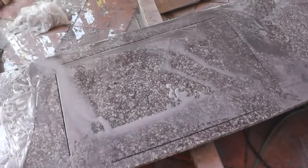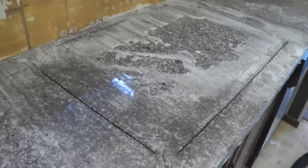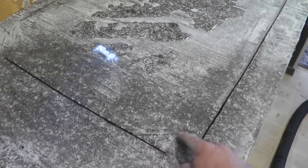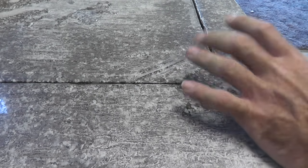I've just finished this fourth cut, and now we'll very carefully take it inside and finish up these corners with a grinder. We were able to successfully move this honker back into position, and now I'm going to use my grinder to finish this cut. I'll start by going diagonally at each one of these corners to remove this big piece out of the middle. And then I'll just start working around these corners and making the curve. I'm using a vacuum cleaner as well as a grinder to hopefully suck up some of the dust, because this won't be a wet cut, this will be a dry cut.